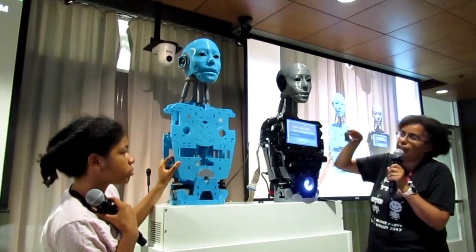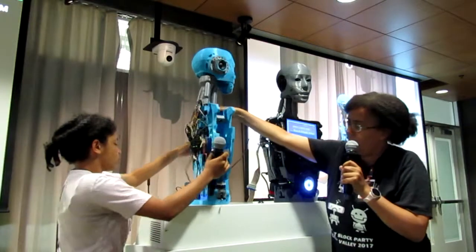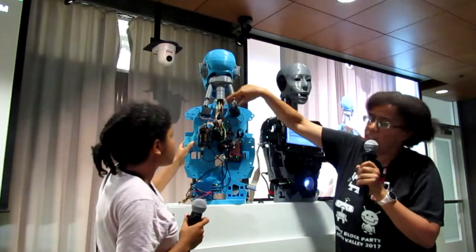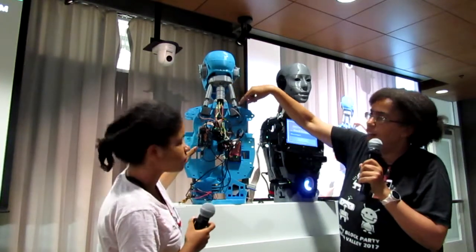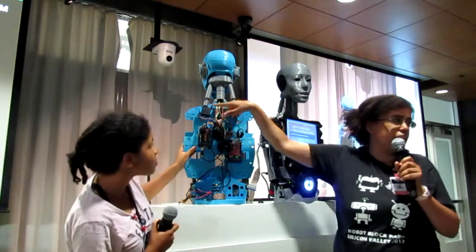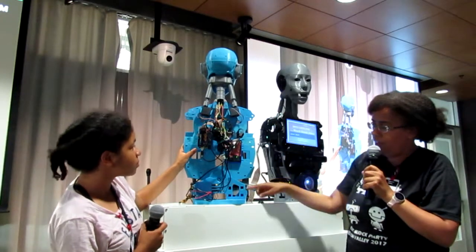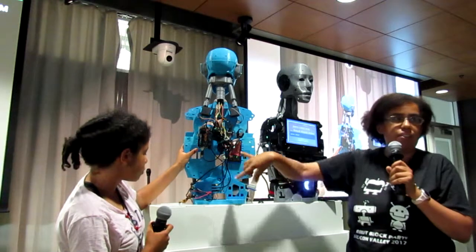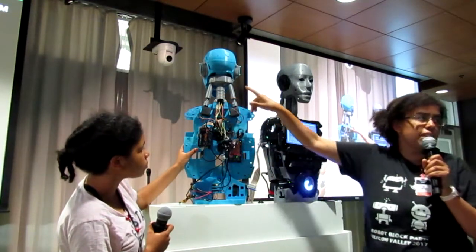Oh, and one thing, you can maybe turn yours around very carefully. So on these, you'll see there's times where there are 2 motors here, and for the design, he'll have us hack them so that one line is controlling both of the servos. So then that reduces the number of signals. So this one has that one line controlling both of the stomach servos, so they move together. And this controls both of the neck servos, they move together.